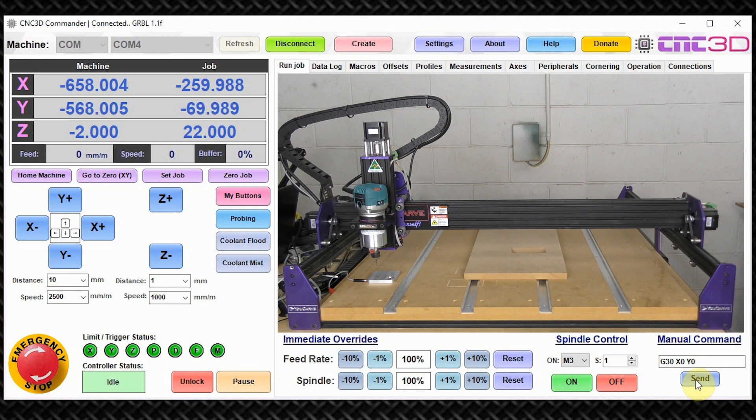Keep in mind both of these functions will persist in memory, even if you turn the machine off or hit the emergency stop — you can still retrieve these values. They are based on machine coordinates, so they do relate to where your homing position is. The only way the G30 or G28 numbers can change is if you physically move your limit switch or adjust your machine in size.